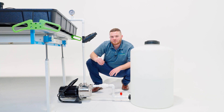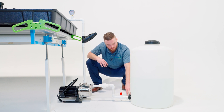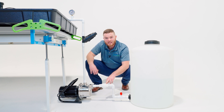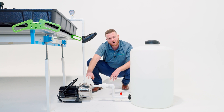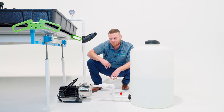Now we're moving on to the pump and filter assembly. As you remember from our previous video we've installed a bulkhead at the bottom of our reservoir. We've added a ball valve shutoff and on this particular system we've added a check valve to prevent any siphoning issues back to the reservoir and also to keep water in the pump so it always stays primed. Remember when you're installing this to put it in the right flow direction.